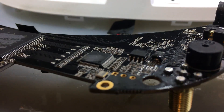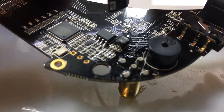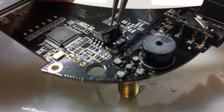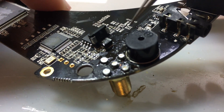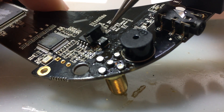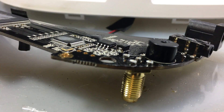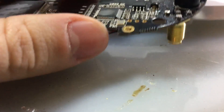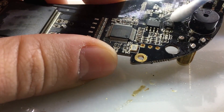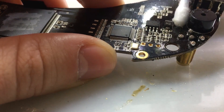Another way to do this job, if you don't have a small enough capacitor or a hot air gun, is to solder the capacitor on its side. That way you get access to both the PCB pad and the pad on the capacitor, and you can create a big solder blob to connect them. Now all I have to do is clean this with some isopropyl alcohol and it should have fixed the problem.